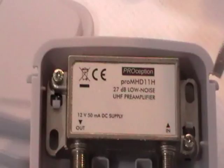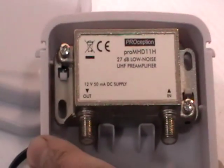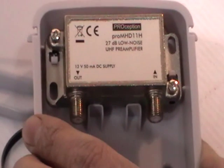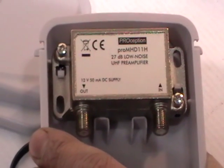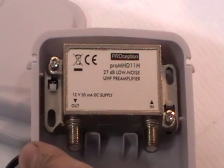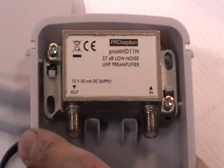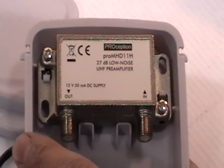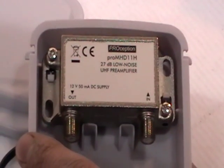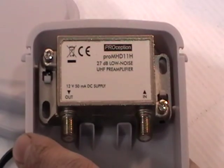These are screened, and the importance of being screened is that it filters out signals below the UHF threshold — things like tetra interference and CB radios. A lot of interference problems have arisen in Ireland in the last year or two as the new Garda radio system has been rolled out, and these are excellent for blocking against that.